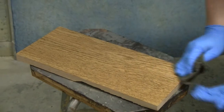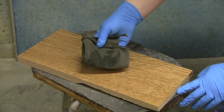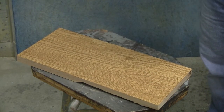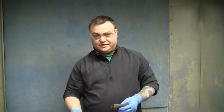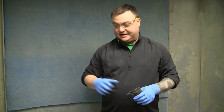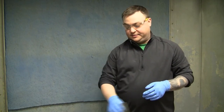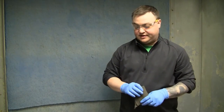After a minute or so, take your clean rag and wipe the surface in long, fluid strokes, removing any excess stain. The only stain that remains should be what's been absorbed into the wood itself. Repeat this process over the entire table. You can come back after a few hours and test a hidden spot to see if it will absorb more. In summary: sand thoroughly, apply a liberal amount of stain, let it absorb for a minute or two, then wipe off the excess with a clean rag.